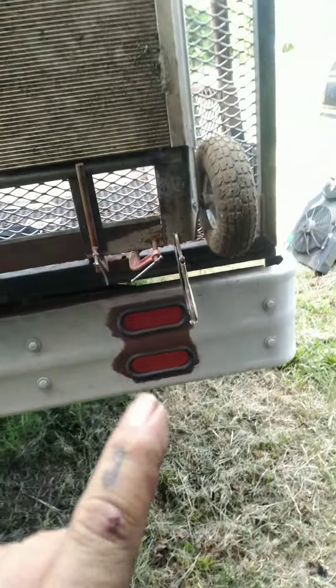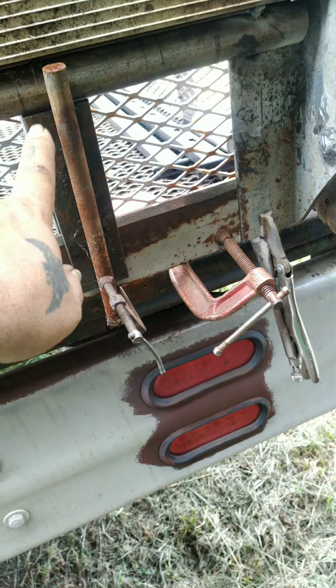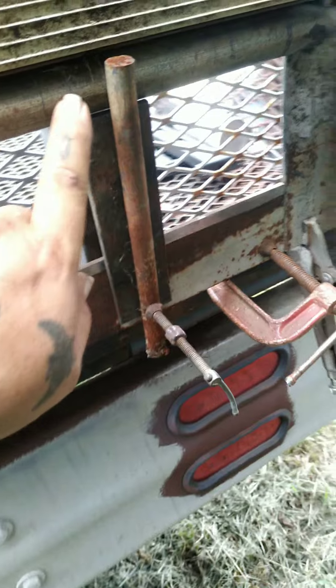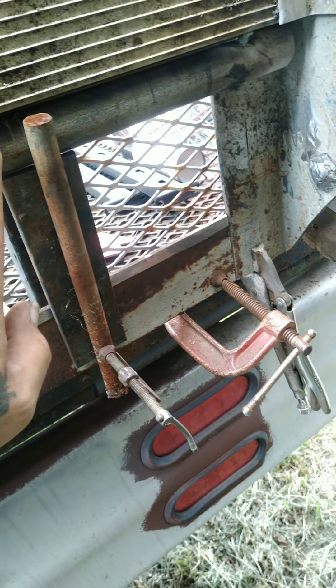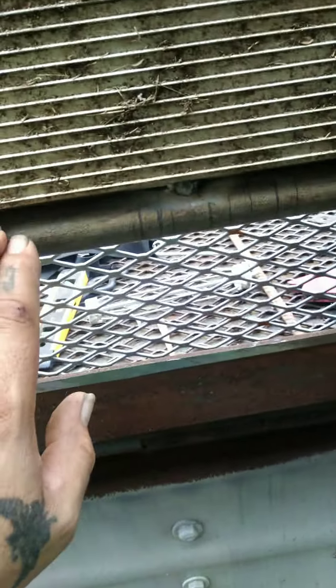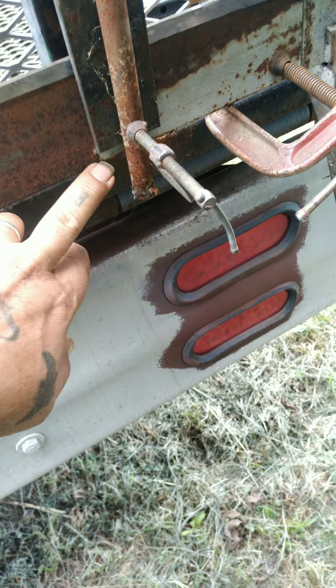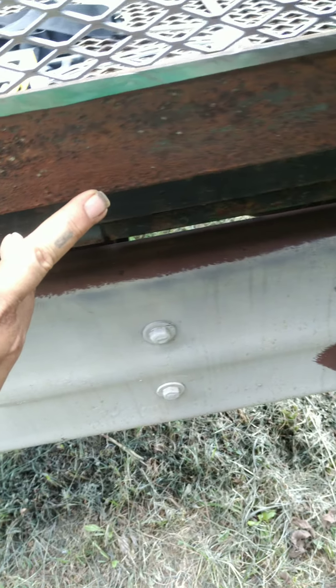I got my plate cut seam together all the way across — I'm gonna weld it. Then I'm putting these rods up underneath so when I put my expanded metal on, it'll ride completely over top and around this edge. I'll take these panels out, flatten the expanded metal, hammer it over and roll it over this edge of the pipe, then weld it in place. The same thing down here — wherever it touches this edge will be welded solid, creating a nice little inclined ramp.